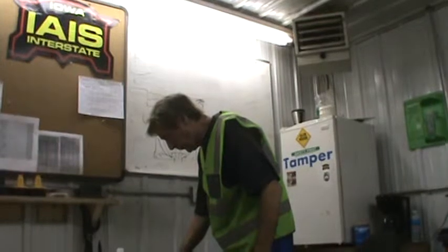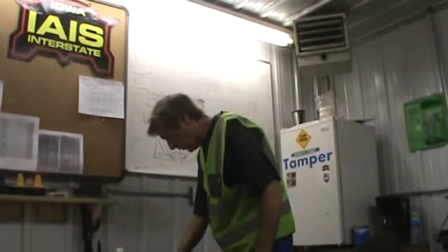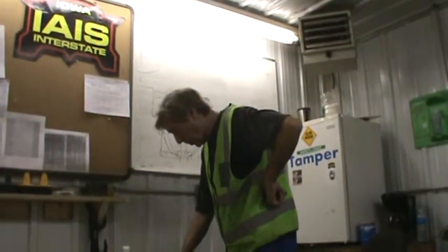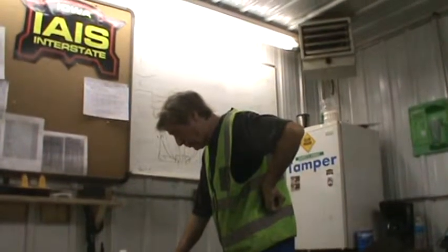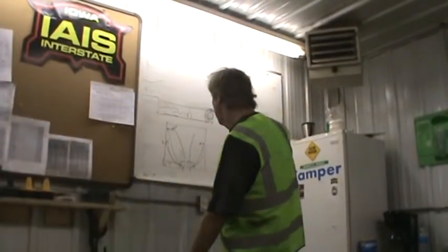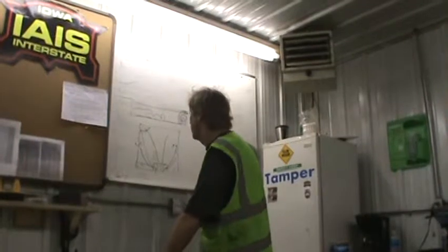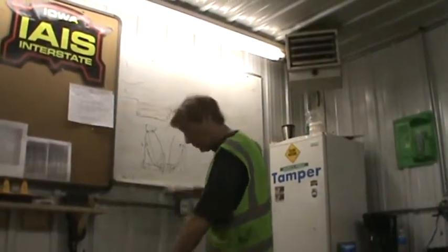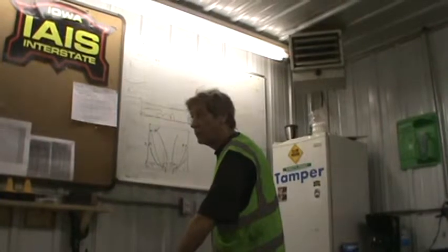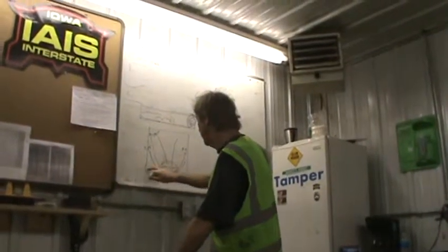I noticed that when we were firing here the last couple of weeks, we don't have a lot in the corners — you guys don't put a lot in those rear corners. We heel a little bit. We'll start off, we'll heel it up, and then by the time we get to the end... What's the best way to carry the fire? The depth and from front to rear corners? He said level — level with a little bit on the front sheet. A little heel actually on the front, but not too much. But you typically didn't carry big heels in the rear corners. No — flat. The only heavy is underneath the firing table, as I roll it like that. Definitely not heavy in the corners.